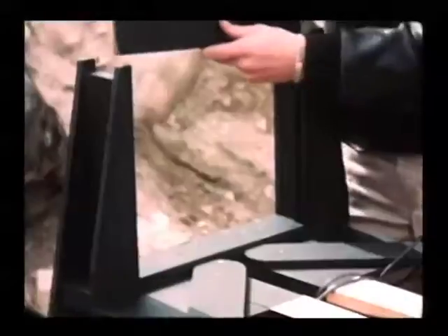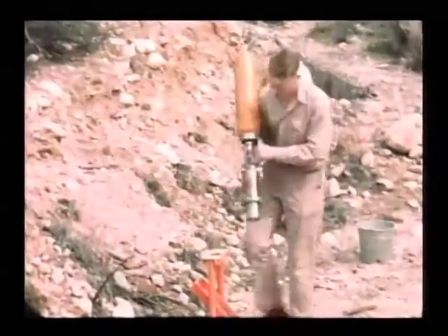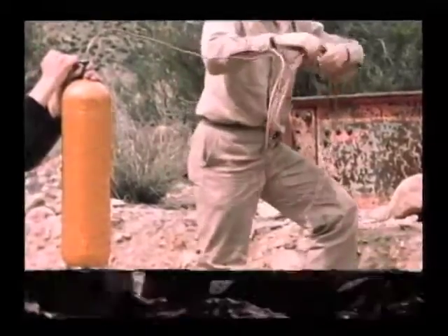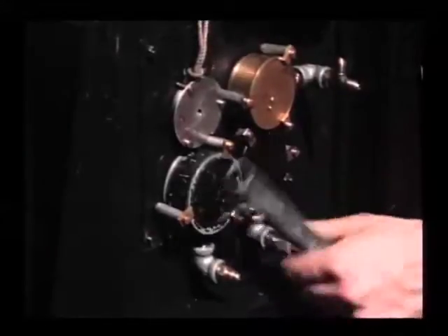The data consists of a 16mm camera photographing a board with pressure gauges and a stopwatch. A quarter-inch copper line brought over the top of the hill to provide the nitrogen pressurization, and another pair of lines for the chamber pressure and the peroxide tank pressure.